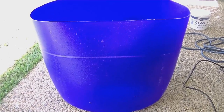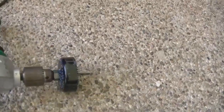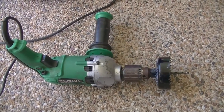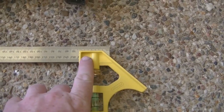The first job is to mark out on the inside where I'm going to drill my first set of holes. I'm using a hole saw with an 86mm diameter. Using a Z-square, I'm taking 42mm — roughly half of 86mm — and spinning it around the edge to mark off as I go around the bottom. That line is what I'll use to drill roughly horizontal all the way around.